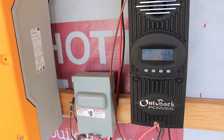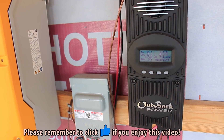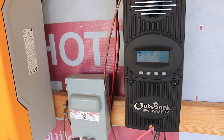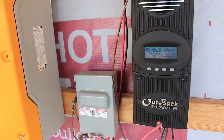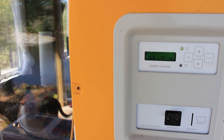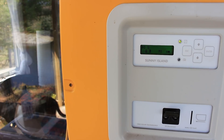I run a 48-volt system. You can see right now that the charge controller is putting in 60.4 volts at 10.8 amps — 660 watts. It's already put in 3 kilowatt-hours today and it's in absorbing mode. The battery voltage reads 59.8 volts right now and the state of charge is 93 percent. That's pretty good. Typically, 48.5 volts would be around 50 percent, which is when you want your inverter to shut down.